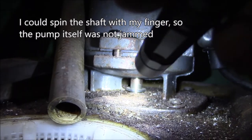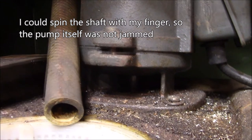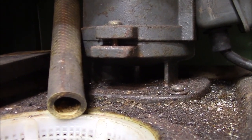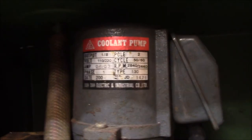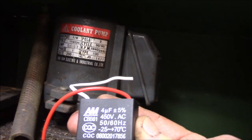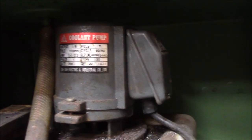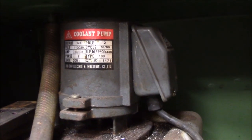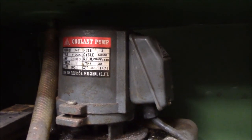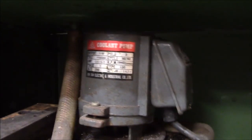There's the shaft under there, and it wasn't spinning, so I knew it was the motor and not the pump being jammed up. Eighth horsepower coolant pump — yeah, that's working again. Two of those for about ten dollars, and they arrived within 24 hours — can't beat that. I did test the new capacitor and it tested just a little over four microfarads, so that seems to do the trick. I'll put a link to that part in the video description if you need to get one. As always, thanks for watching.